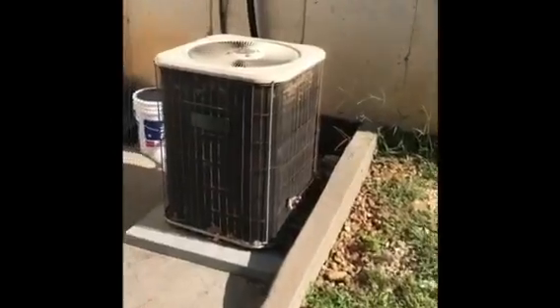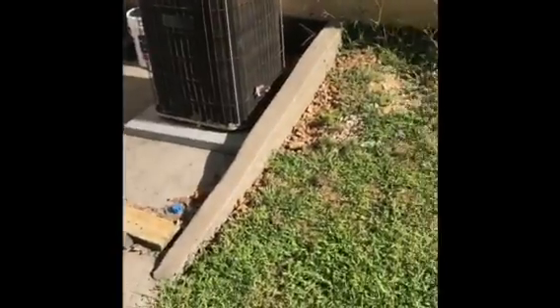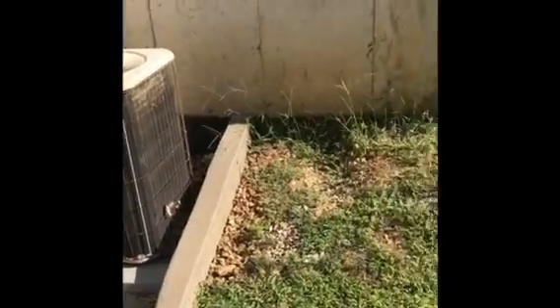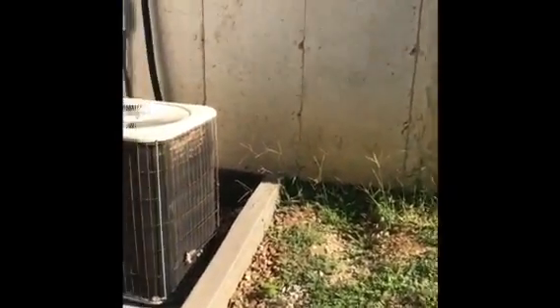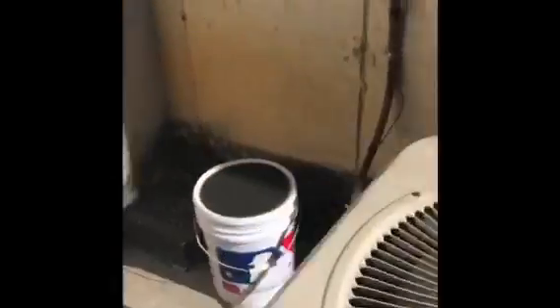Here's our outdoor condenser — it's a three and a half ton unit. The customer would eventually like to put a stairwell from the deck around this corner and back down, which is why the concrete pad has been poured. So we're going to move this system over to this area, which may need a little bit of rock and dirt. We'll put a new preform pad underneath the unit — probably 10 to 12 pavers — to make sure everything's nice and level. We're going to replace the refrigerant lines coming out of the house, running them along the bottom of the siding and back down the wall. New disconnect box with electrical whip going into the unit.